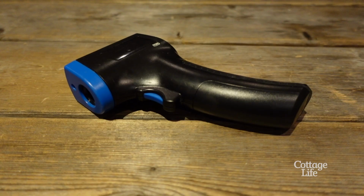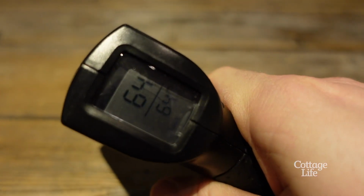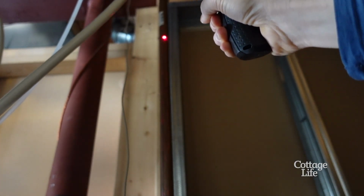If nothing is obvious, you can also invest in an infrared thermometer gun, which will run you anywhere from $30 to $100. You can take temperature readings along the line until you've located the issue. Then get to work on thawing it.